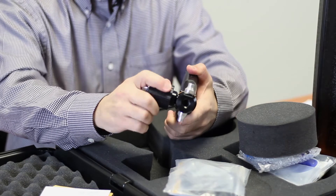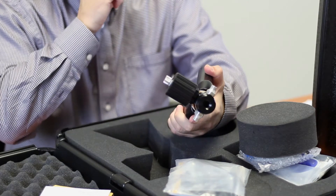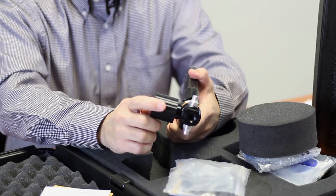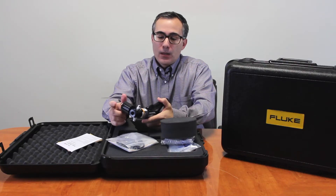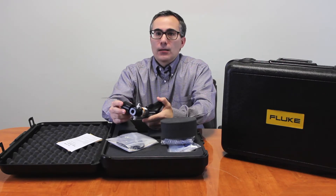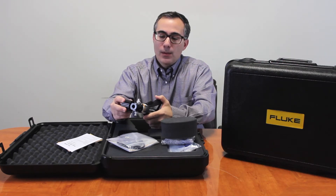Now there's a fine adjustment here. This adjustment allows you to lock in a pressure. So let's say you wanted to lock in 100.0 psi — if you're trying to use something like a bicycle pump, it's going to start leaking and you're not going to be able to hold that for very long to make your measurements. So that's what these knobs are for.